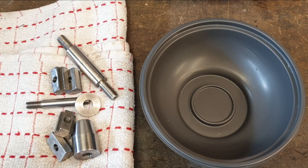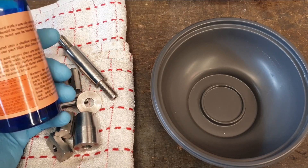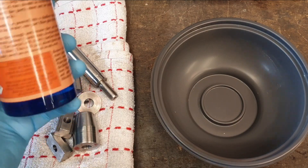All the parts have now had a good clean and they've been dried off. I've also just given them a quick blast with a heat gun just to make sure there was no moisture lurking in the threads. Now I'll prepare the Philips cold blue — it says it needs to be mixed with water, one part of blue to three parts water. So let me go and do that and then we'll give it a go.